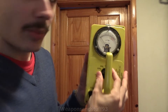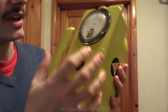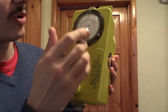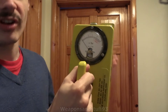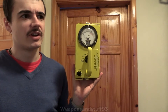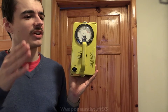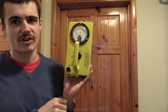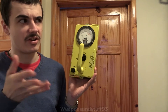Another disadvantage: you'll notice that it only goes to times one. The 715 goes to 0.1, meaning that the scale of 0 to 5 roentgen becomes 0 to 500 miliroentgen on the 0.1 scale, which is quite a practical low range for reading. The problem with these doomsday ionization chamber units is they're designed for when you've gone beyond what the CDV 700 Geiger counter — which goes up to 50 milliroentgen — can handle. The idea was that the CDV 715 started at 500 milliroentgen, so each one would overlap onto each other. Ideally you'd have wanted the CDV 700 to go up to 500 milliroentgen with a times 1,000 multiplier, but they just didn't engineer it to do that.